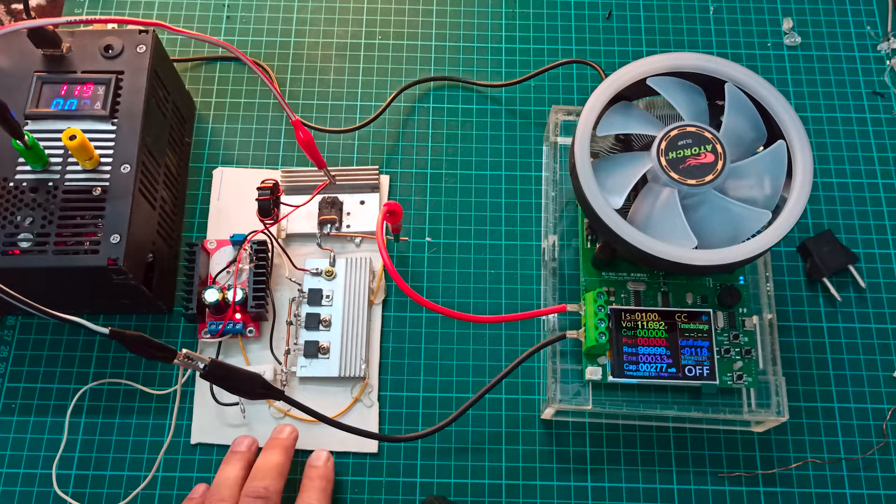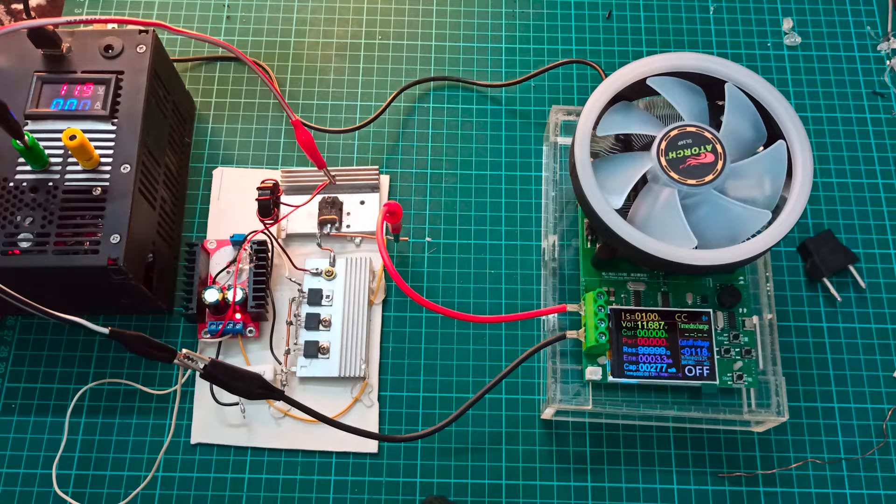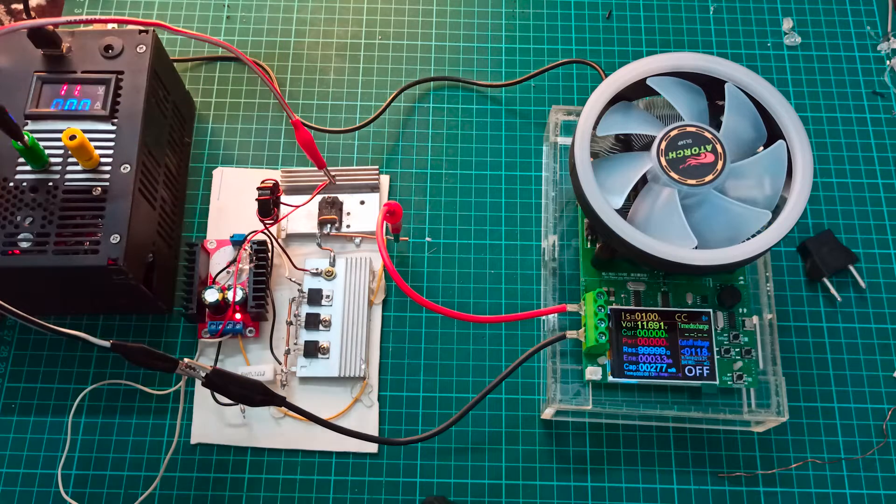This is the first version of the circuit and there are some upgrades that still need to be done. The rectifier I am using here is a 20DL2C, which is capable of providing 20 amperes continuous and 30 amperes in pulsating mode. However, I think this single rectifier is not enough for the desired output of around 10 amperes or higher. Adding two rectifiers here would give us a further improved version of this circuit.